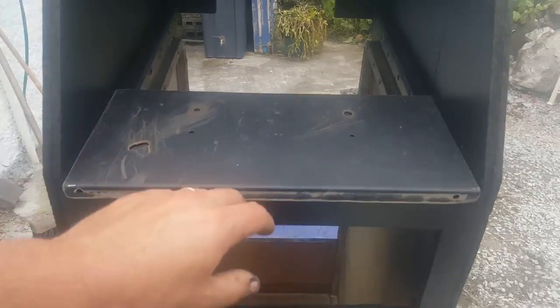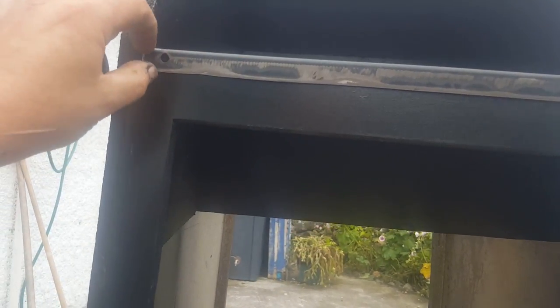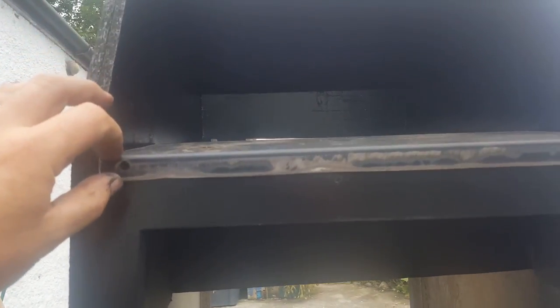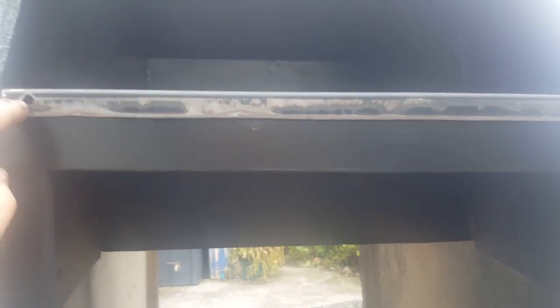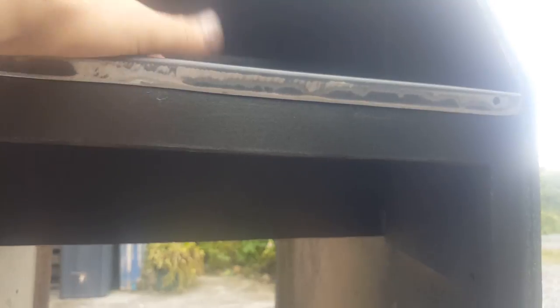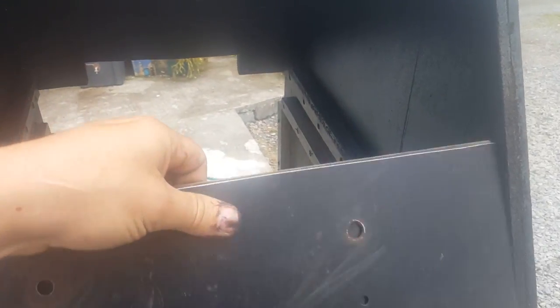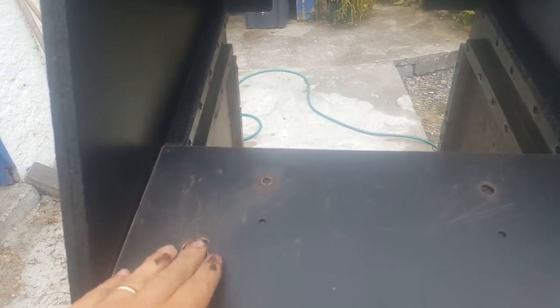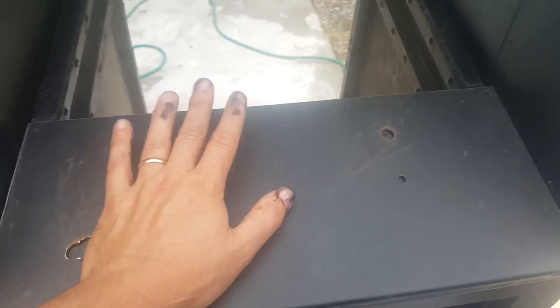So there you go. And also, this was the panel metal I cut. I've actually cut another one from the other half, because the ledge here was deeper. Normally what you have here is a wooden panel, about that thickness, and then there's a T-molding groove and T-molding going here. But I kind of like the feel of metal for a control panel in general. So I'm gonna use this. I bond these together with the epoxy resin, and then fill the holes, and then put my overlay in place and drill my holes for the joystick and the buttons.